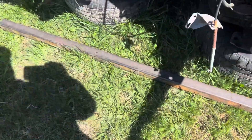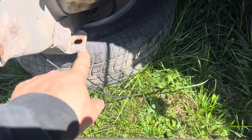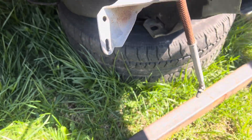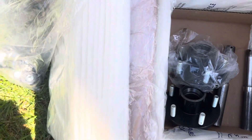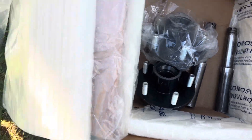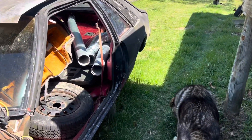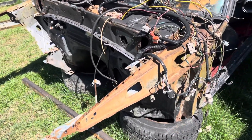I got some old square tubing. What I'm going to do is center it up and drill my holes through there so I can bolt this to there. Now this is if you don't have a front crossmember. I bought this kit where I can weld in these spindles and hubs — obviously not weld the hubs in, but weld the spindles in. I'm just going to build an axle that I can bolt to it. I can pick it up from the back with the tractor and go set this wherever I want. So that's the plan for this right now.